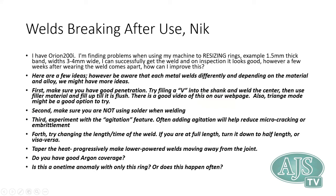A V-cut to prep the joint is always a good idea — there's a video demonstrating this on our webpage. For the 200i, try triangle mode: it provides a low-power weld sustained much longer than other modes, and since time is the biggest contributor to penetration, this helps significantly. Triangle mode is only available on the 200i, not the 150s or 100c. On S or C welders, a V-cut is your primary option. Also make sure there's no solder in the joint, as solder will cause cracking.